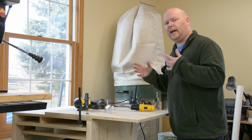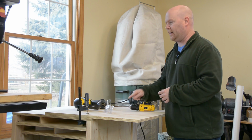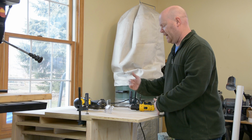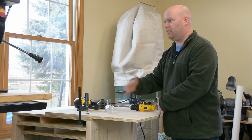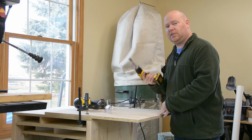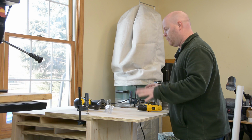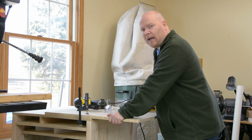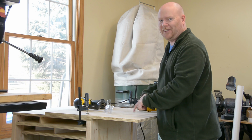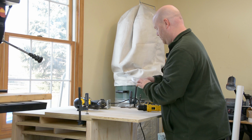Well, unfortunately, I don't have a hole saw or a circle cutter big enough to cut this thing out. And of course, exactly where I need this hole is about 1/2 inch of depth that I don't have even on the brand new giant drill press. We're going to have to do this the old-fashioned way, drill out a couple starter holes and cut it with the jigsaw. But fortunately, the cabinet that I'm making is the perfect work height and width for using as a workbench for this particular piece. So off we go.